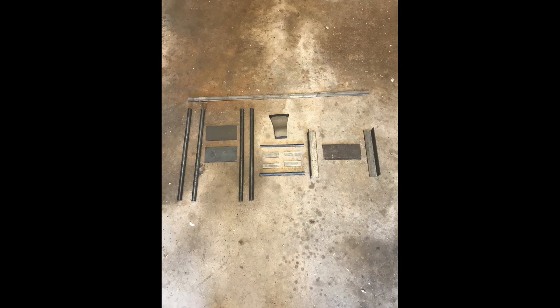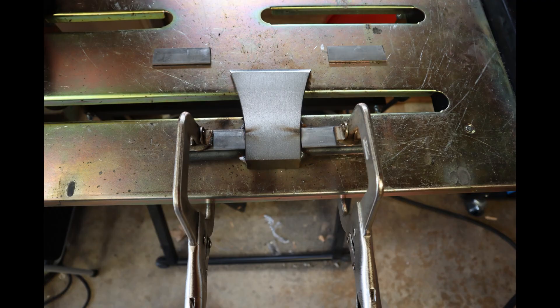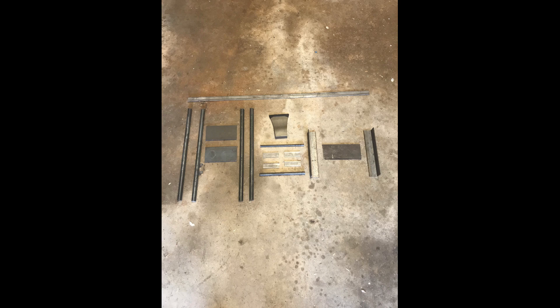The axe is directly supported by two 8 inch solid bars of ½ inch and ⅜ inch diameter, and four 1 inch by 2⅞ inch by ⅛ inch flat bars welded to the 3 inch by 5⅞ inch by ¼ inch flat bars. The foregoing structure sits on two 1½ inch by 9 inch by ⅛ inch angle welded together by a 3 inch by 6⅞ inch by ⅛ inch flat bar in the middle to complete the structure.